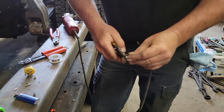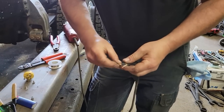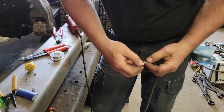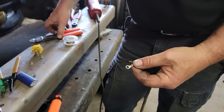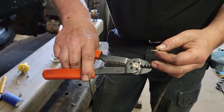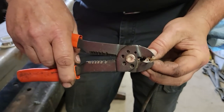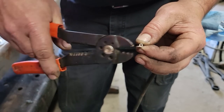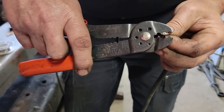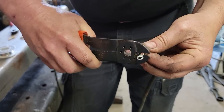It's important that we don't strip this back too far. We just want it to go into the body of the crimp connector and just be able to see the end of it come out. These are meant for uninsulated crimp connectors — you see how it has the thing that pushes down. I don't want that on the top because it just deforms the top, so we put it on the bottom. Put it in the valley, in the right slot for 12 to 14 gauge, and crimp her down.